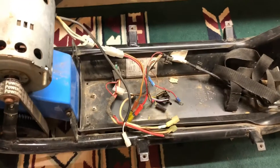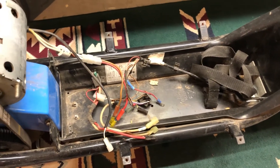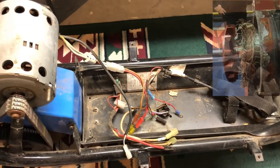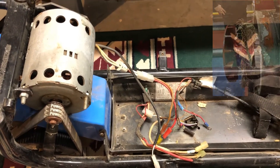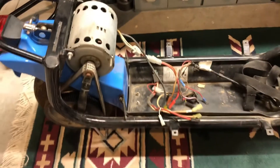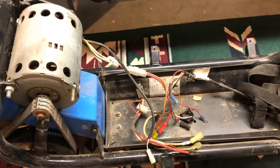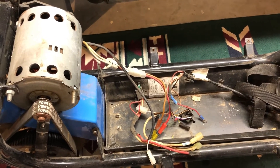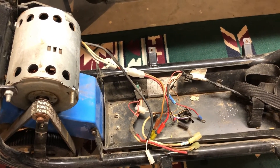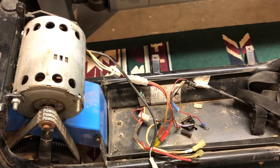So what are the problems that can happen by trying to put a 48-volt battery on this? Obviously you're going to over-speed the motor — it's going to burn out, or you'll wipe yourself out because the thing will go too fast. I'd like to have this thing not burn out right away, so I'm going to build the controller to limit the voltage output to somewhere between 24 and 30 volts — give it a little more speed than stock.